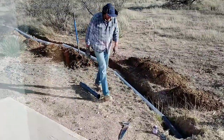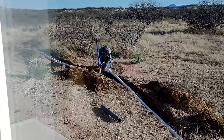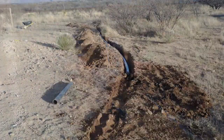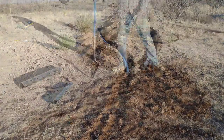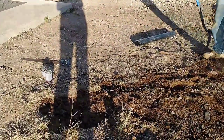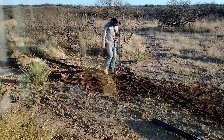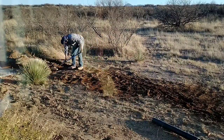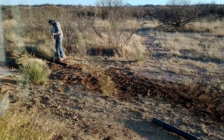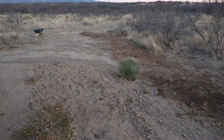Now I'm transitioning to the white pipe — a flexible white 3-inch pipe that comes in 10-foot lengths — gluing and sealing those joints as I go. The pipe is flexible enough to follow the curves of the trench, but it's still thick and heavy-duty material with a really long life. That pipe runs all the way down to the gravel pit area, where I terminated it and covered the entire end with rock so small critters can't crawl up in. Once that was all covered, I started the backfill process. Now we just need to find the perfect tree.